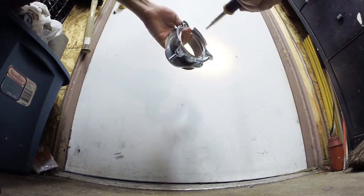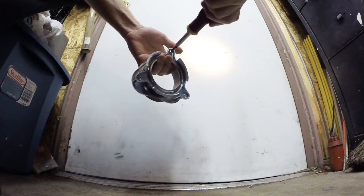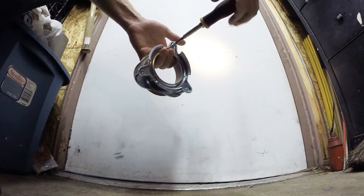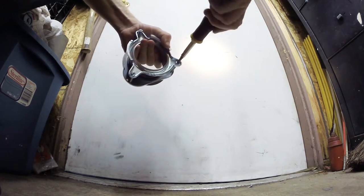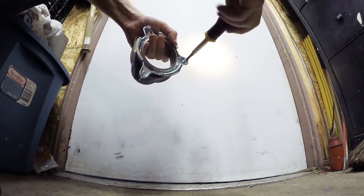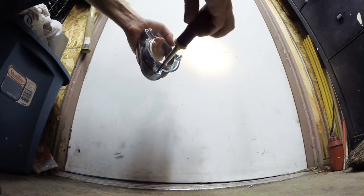You got a brand new sink tray. I actually found a brand new one so I could show you again. So if this was in place in the sink, you would just loosen these three screws, and you got to loosen them well enough so that you can slide it up far enough. You won't do yourself any favors if you try to only loosen it up a tiny bit, because to get in at that snap ring is a little bit tricky. So loosen it up about halfway, sufficient.